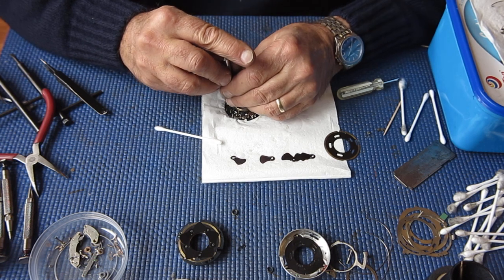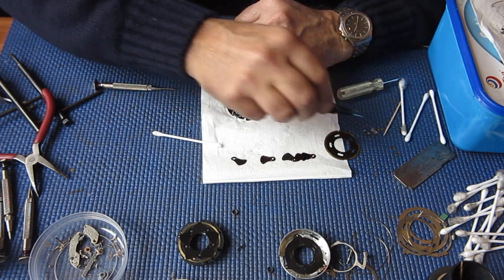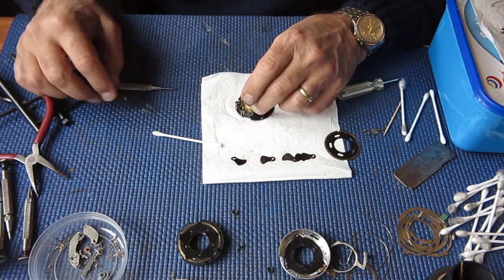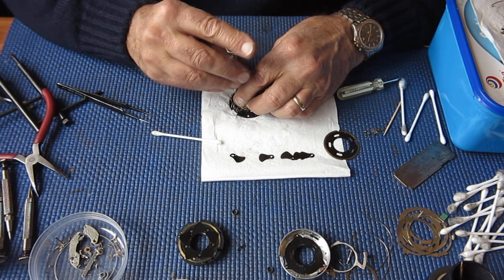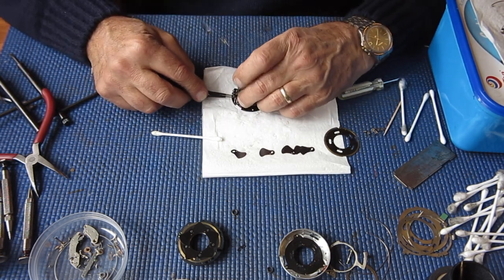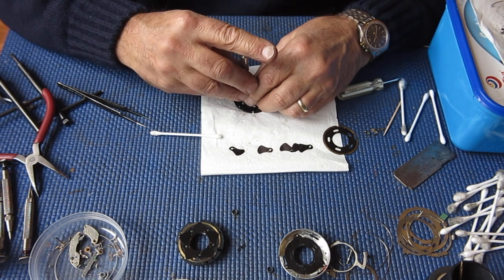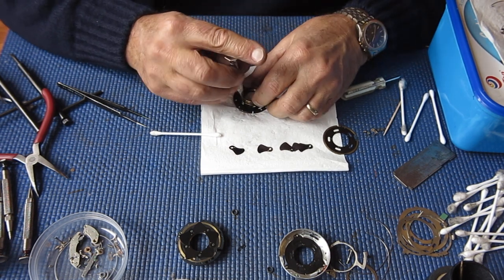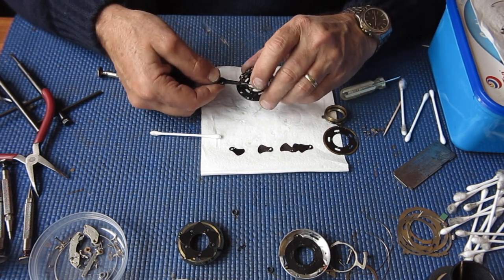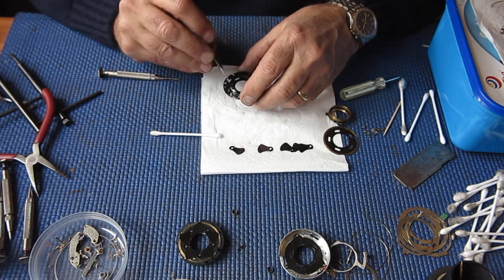Of course, the four pieces wouldn't just fall off, because unlike most retainer rings where the retainer ring is simply pulling something back against a flat surface, these retainer rings seat inside a groove. And because they're seated inside a groove, there was nowhere for the pieces to fall away from the thread, even once they'd been cut loose. So I had to force them, shuffle them around the threads repeatedly, one after another, until such stage as they'd lifted out of their retainer groove, and I was able to move them. But I have to say that is unusual.